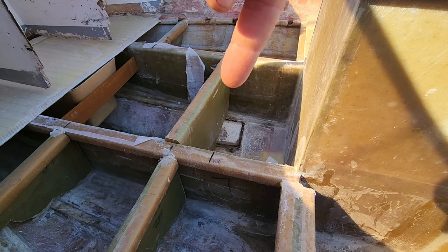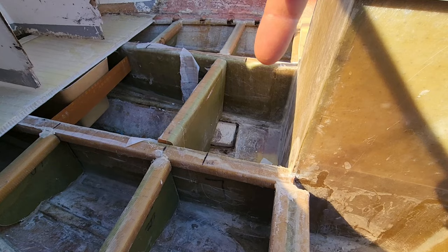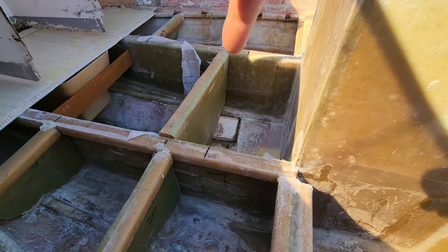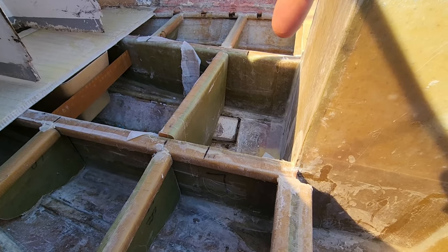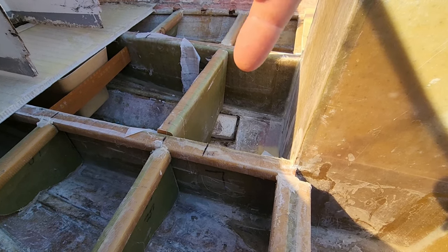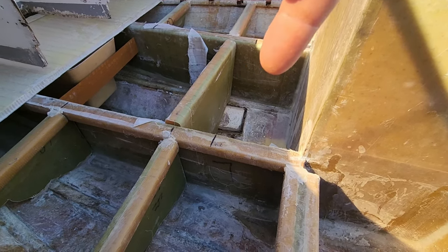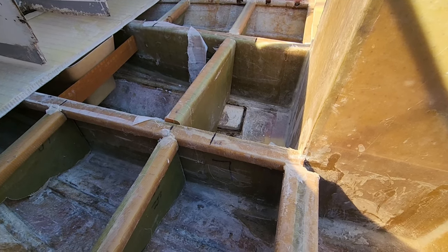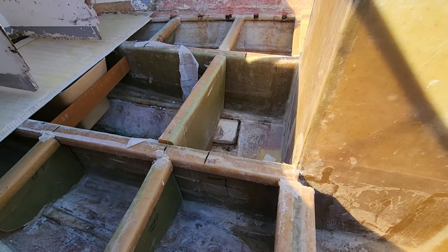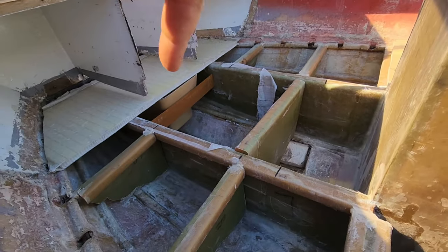We always carry a big cooler box to keep the bait frozen and it's always in the way, so I'm putting one in the floor. It will be the size of a five kilo box — big enough to lay the five kilo flat with maybe a couple of frozen bottles to keep it frozen. Because everything is done with PVC foam, it's basically going to be insulated like a cooler box. I'll put a flat surface in the bottom, bond it in, radius it nicely, and put a plug in there so any water or ice melt can drain out.